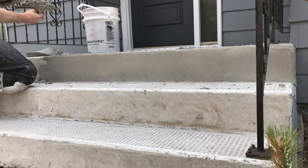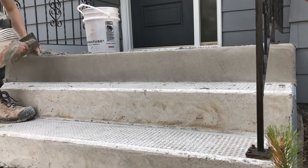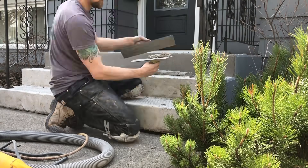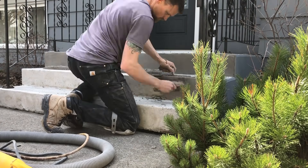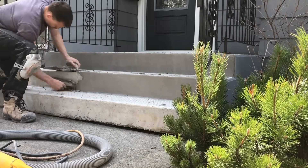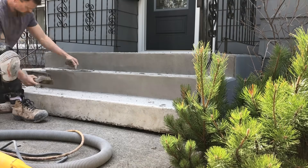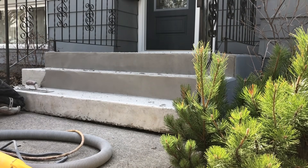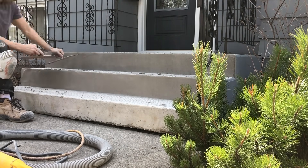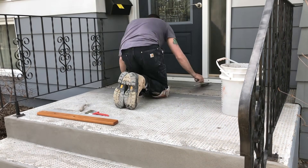Rather than skipping frame by frame I want to speed up the process so you can see the whole step. You do the first riser, then go back and make another mix before starting the second riser, so you don't have too much product sitting in your bucket — over time the TF structural will start to cure, especially when in volume. You place the product on the riser, it doesn't have to look perfect at the beginning, and you go back to finish it with your trowel. About 45 minutes to an hour after the risers were installed I started the skim coat process.